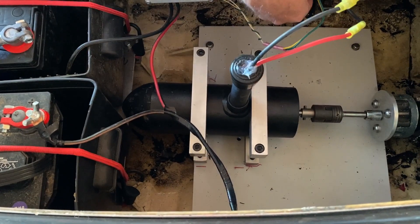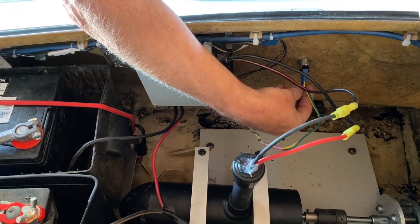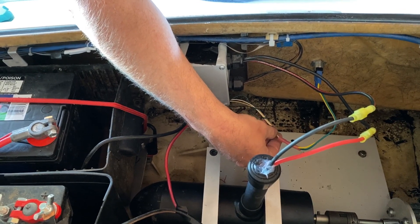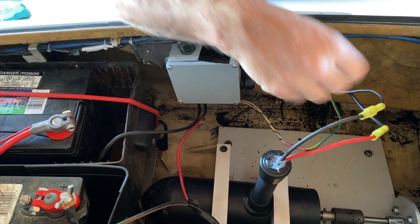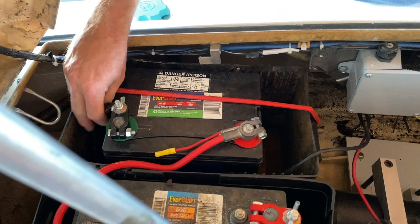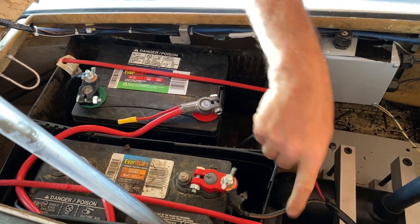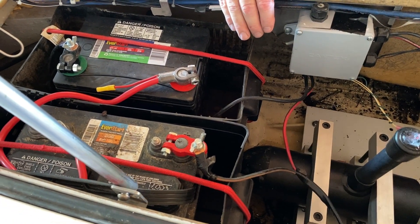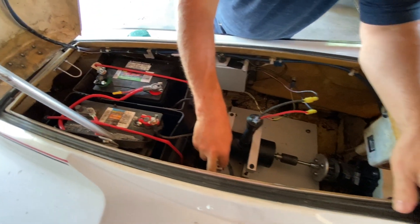We have a switch — it's actually a key switch. You've got two wires: the yellow and the green wire. There is another wire that could go on the switch which would be a constant wire, but that would make it run constant rather than pulsating. We also have wires coming out of the box that go directly to the motor. The other two red and black wires — one goes to the negative pole of one battery and the other to the positive — but it also runs through a switch, which is a 60-amp breaker, allowing it to break if there's a problem with the current.